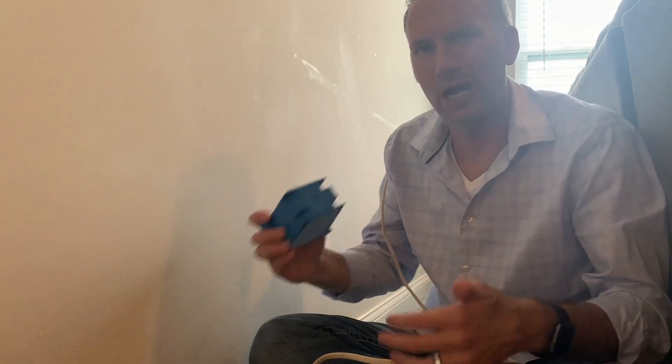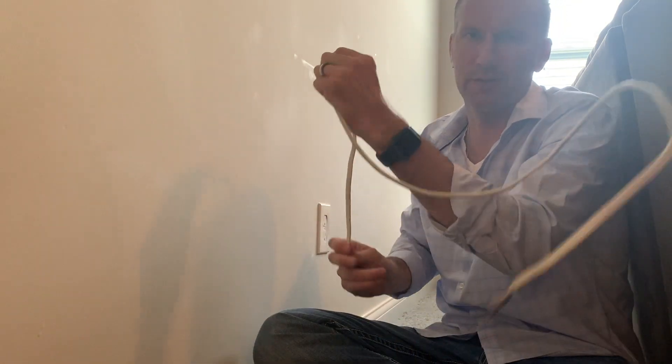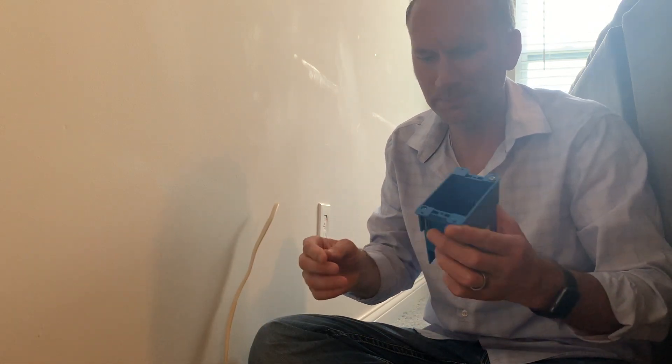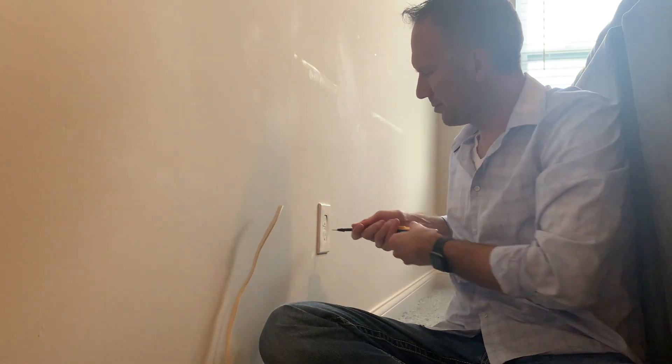I did this because I didn't want to have to do a lot of drywall repair — that's the reason why I used this box. Outside of fighting the wire between the wall, because it is pretty rigid and as soon as it touches anything it bends and starts to come down, that was the longest part of this whole process. If you didn't have to do that part of it, you're looking at maybe a half an hour at the most. That's really making sure that you have the right stud location, using the right box, making sure you've got the power it needs, and checking your circuit. Once all is done, you go back downstairs to your fuse panel, turn the fuse back on, and then you've got power to it. You can test it again with your voltage meter, plug it in, make sure you're getting power to it, and then you're good to go.